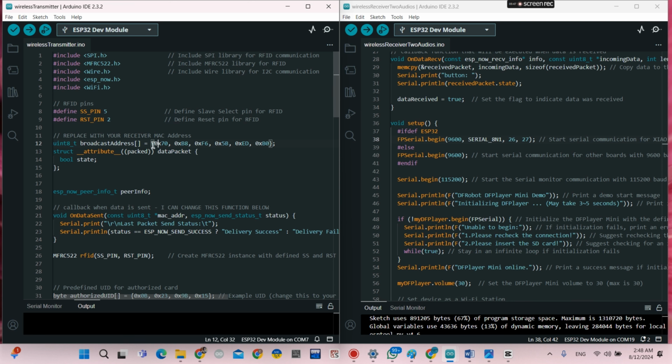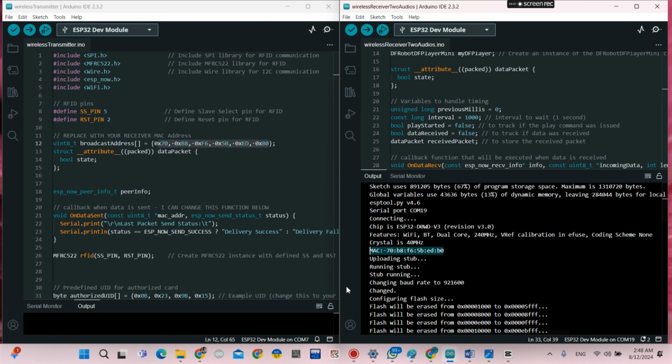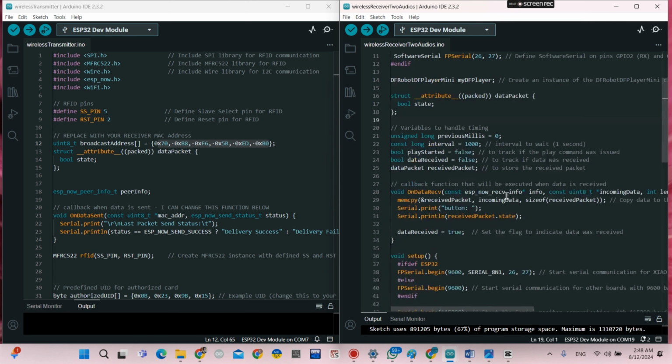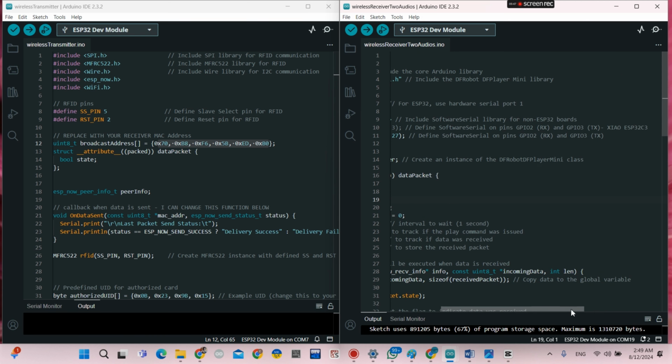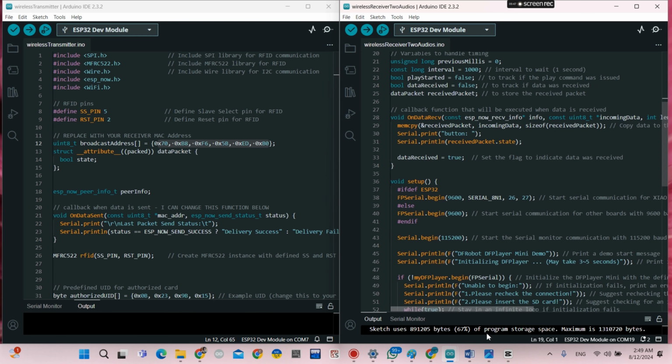If you want to know the MAC address of the receiver board, you can just upload any code, or this code, to your receiver board, and on the Arduino IDE output you're going to see the MAC address of your board. Then you copy the MAC address and put it inside the transmitter code. So now this is the receiver code. I'm going to provide this code in the description of this video.